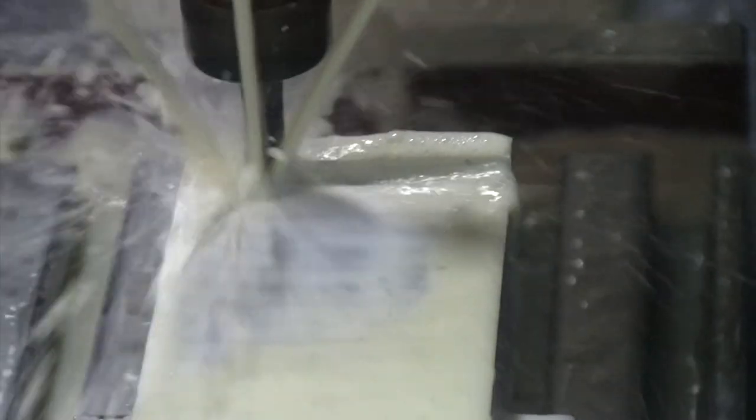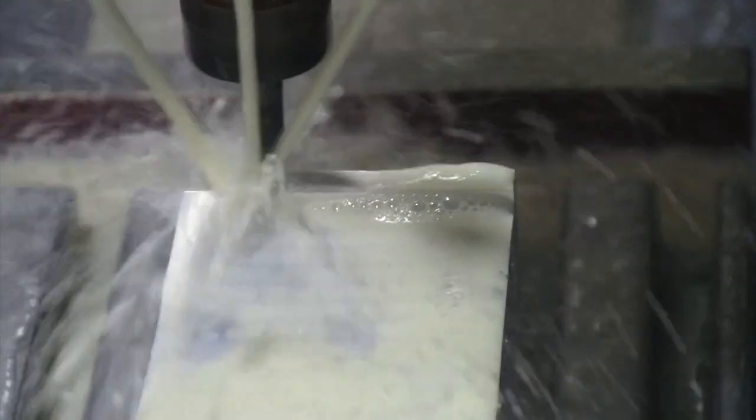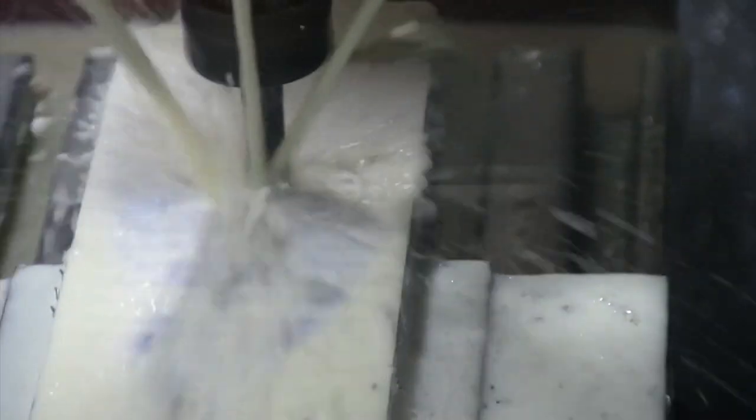And there we go, wrapping up this big cut at depth and then taking this final little finish cut off the edge to make sure that we're setting the overall width on this accurately for that other piece to be able to drop in there. Then we'll move on to the next step in the operation, which for this one is putting these big counterbores in there.